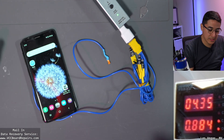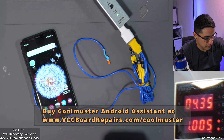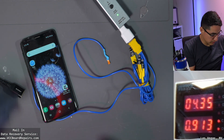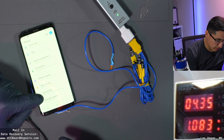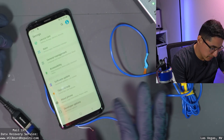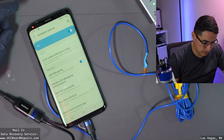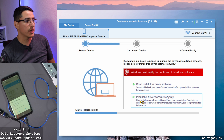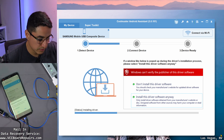To get the data out of this, I have a special program called Cool Muster which I'll link below — it's about $40 and I use it for almost all my data recovery jobs. It works great for pretty much all Android phones. First, go to Settings. They already have developer options enabled. You have to enable USB debugging, then plug in. It only takes about a minute or two to connect and get ready. Once connected you can see all the contacts, texts, and photos.